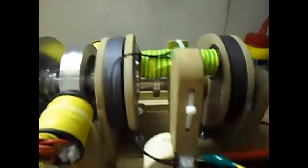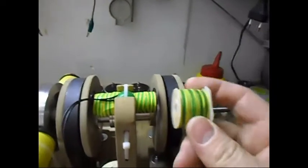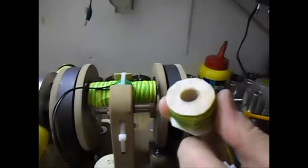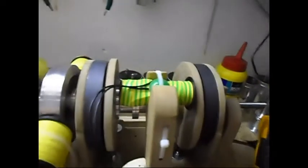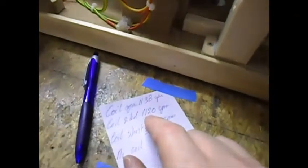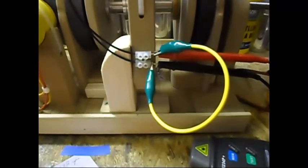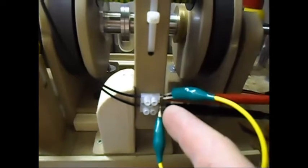In other words, this coil's output is kind of the same as the smaller one, but this coil does not make the system speed up when I short it — this one does. Because when I load this one I get 1120. So maybe I should short it out through a transformer, but that doesn't make sense because I'd have to short it with a very low resistance side to get the same effect as the direct short.